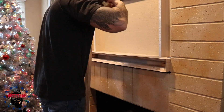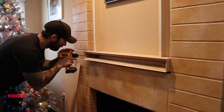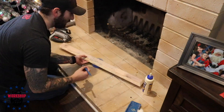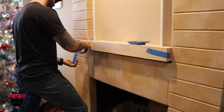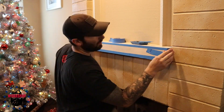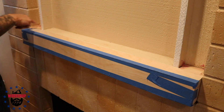Now I'm eating a donut — I think I had two donuts that day — and then I was securing it with screws and applying wood glue. I made sure I put a decent amount of wood glue on this because I didn't have a very good way to clamp it. I used the painter's tape again, but it's hanging off the front a bit, so I didn't want any problems. I put a decent amount of wood glue and cleaned it up later. While the front piece glue was drying, I took some wood filler and filled some of the gaps. Some gaps were a little too big, so I ended up putting more on than I thought, but it worked out fine — once it dried and I sanded it down it was completely seamless.